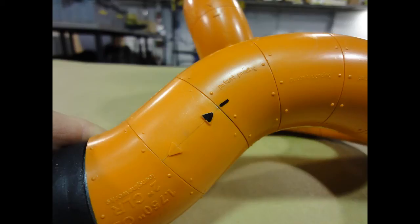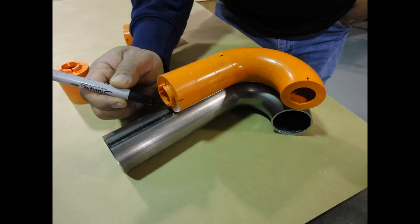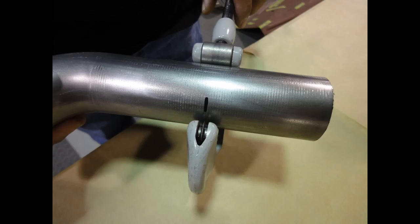In order to achieve a duplicate part, simply match the model to your cut tubing and mark it with the same reference bump or arrow, and voilà — you have a match. Simply place the correct block that matches the mockup and line up the bandsaw to cut precise. After we cut the end on the matching radius, we lay the mockup on top of the tube and mark accordingly. We use a tubing cutter to score the metal, which provides a nice precise line on the tubing — this way there is no mistake when cutting on the bandsaw.